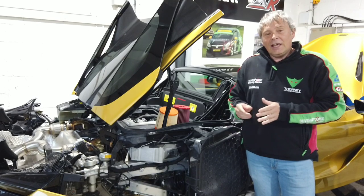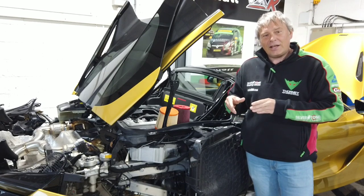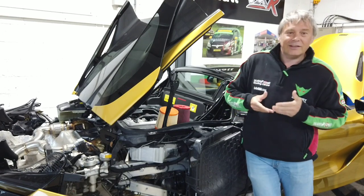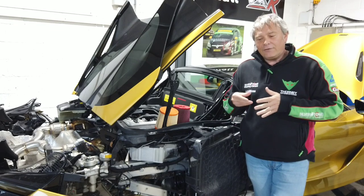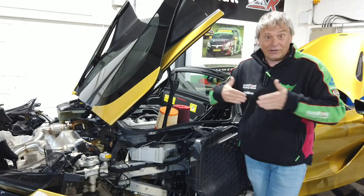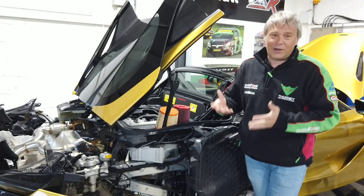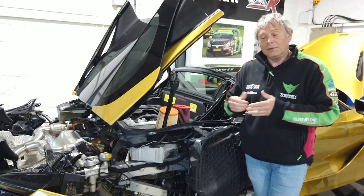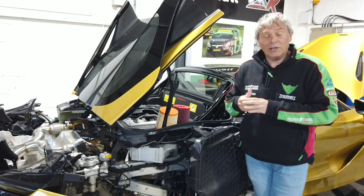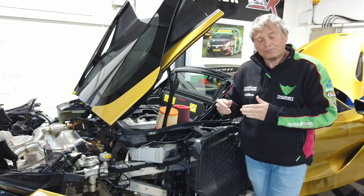The second aspect of airflow is the air used by the engine to make the explosion that moves the pistons. On a turbocharged car, you need a filter that sucks air in and feeds it into the turbo. The problem is you've got to get the air from somewhere — usually the engine bay — and the longer the distance from intake to turbo, the more lag it generates. But too short a distance means too much heat, since turbos generate around 1,000 degrees. That's why in Formula 1 cars, the turbos are quite separate from other parts to keep things cool, and I think we'll see some of that influence road cars eventually.